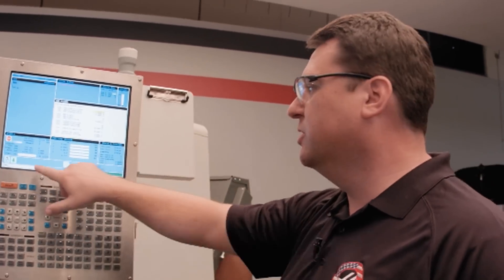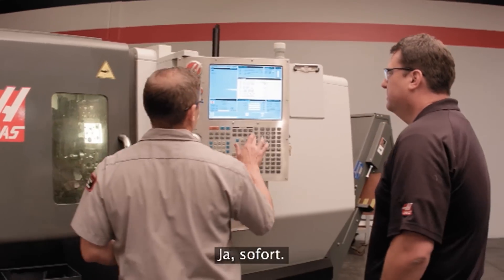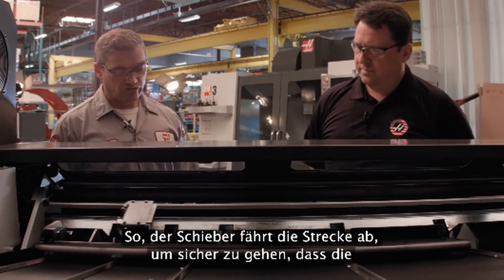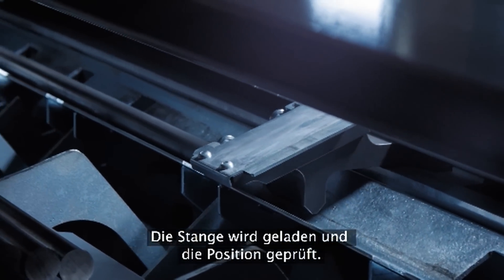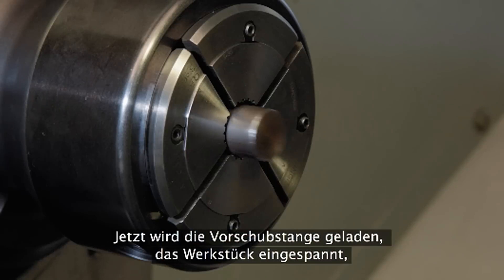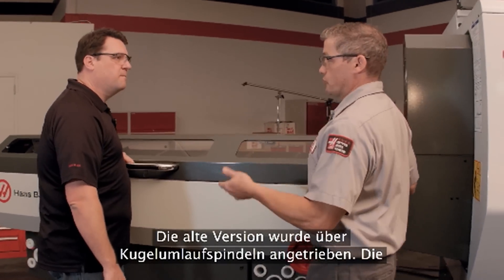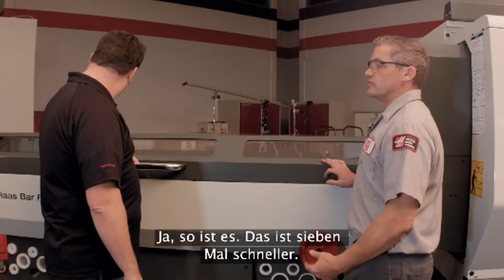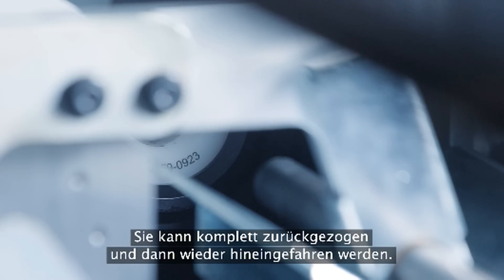So we've already talked about the easier to use Haas interface with those great icons. What about the speed? That's the big thing we improved. Can you show me a bar load and show us how fast this thing actually is? Yeah, let's do that right now. The shuttle's coming forward, making sure there's no bar on the transfer tray right now. Retract. So it's loading the bar — now it's checking position. Now the optical sensor is picking up the length of that bar. Now it's loading the push rod, setting my bar, clamped it, retract — ready to go. How did we get all that extra speed? Well, the old one was ballscrew driven; this one's driven with a belt drive. The servo motors hook right up to a belt that drives that shuttle. It's like seven times faster. No longer do we need to leave a push rod in the spindle liner for a quick push — we can retract back out, run up and push again.